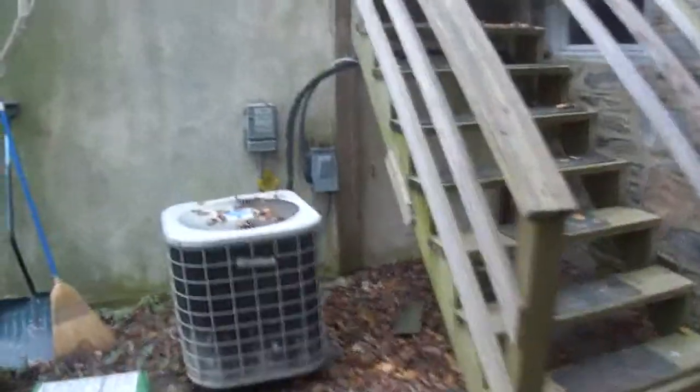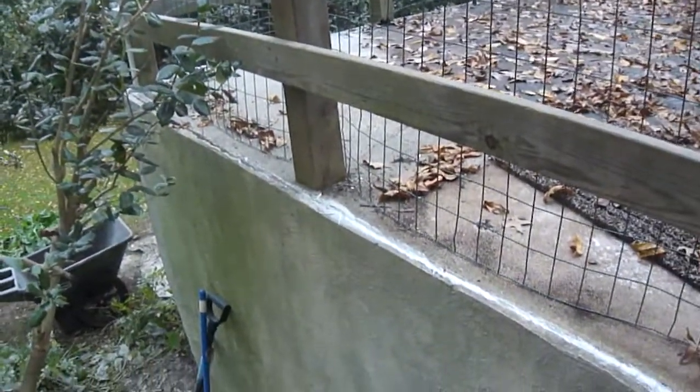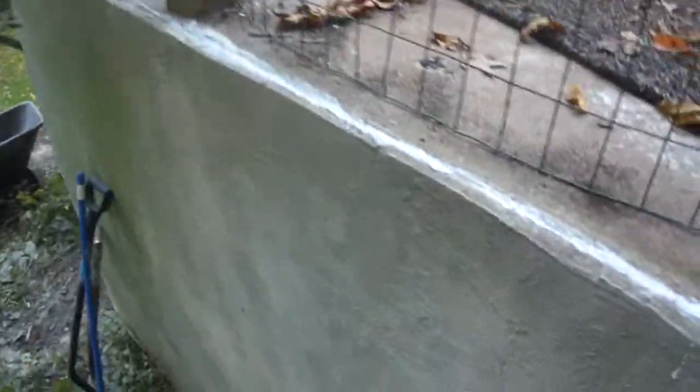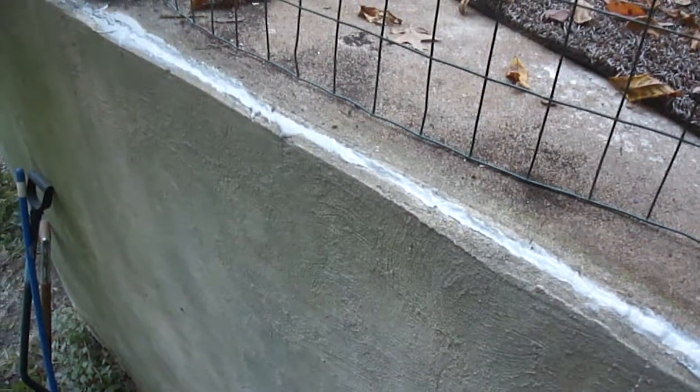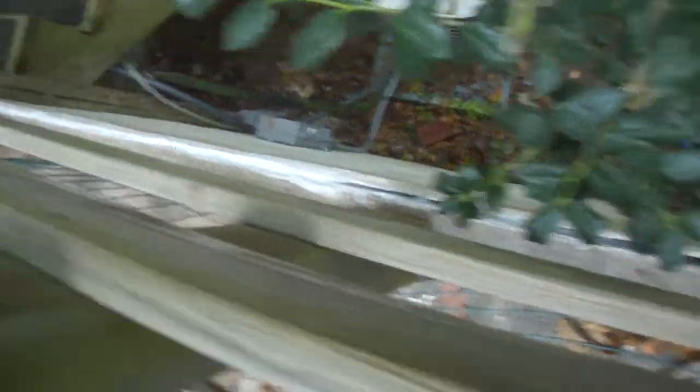The water erosion problem went between the fascia sheathing here — see that there? That's a metal lathing. We stuck it on top of it. It's not even all filled in there. Now, Scott said he put some caulking in that, but it's cracking right off to this edge here. Let's put caulking on that.